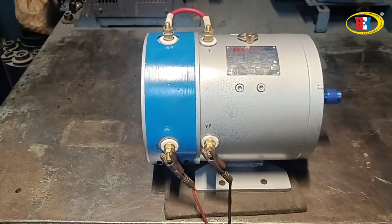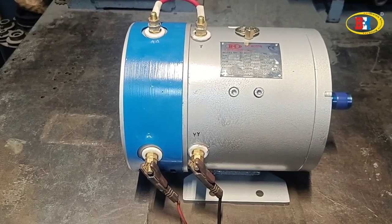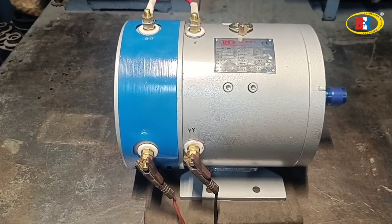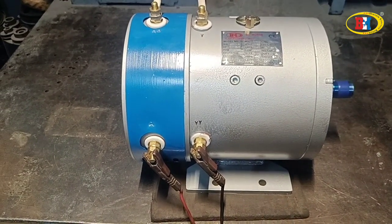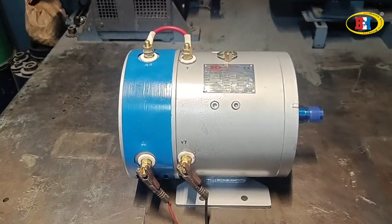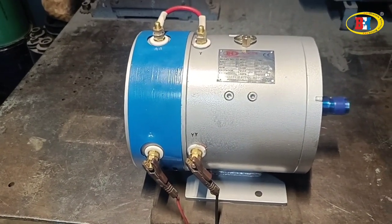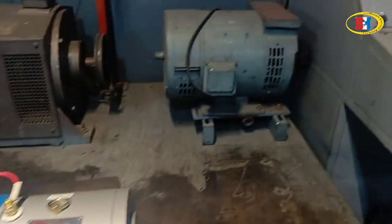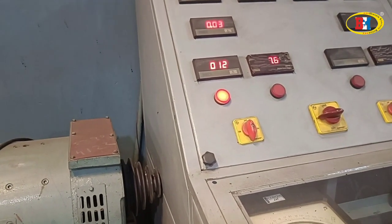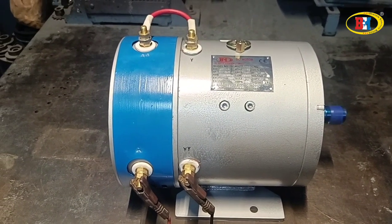This is 100% quality, and this motor's carbon brush life is 3 years — 3 years of continuous running. This is very good quality we have designed. Due to this being a 36 volt motor, we cannot run it continuously at 36 volt without load, so we have given 13 volt and see — it's taking 7.7 amps and it's running with 13 volt.